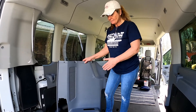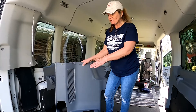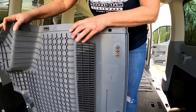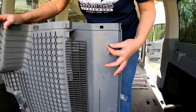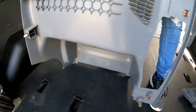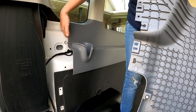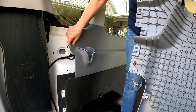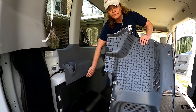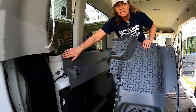We got the interior trim piece off of the rear air conditioner — it was not easy at all. Like the smaller pieces we pulled off, you're going to want to pull straight out on this trim piece and be careful not to break all of the little tabs off on the back. There are also tabs underneath on the small piece. We ended up having to pull the bottom loose and then work this edge off that was tucked under there.